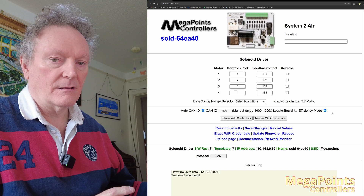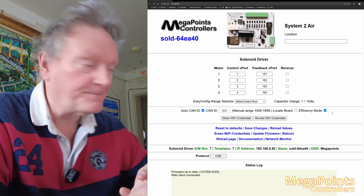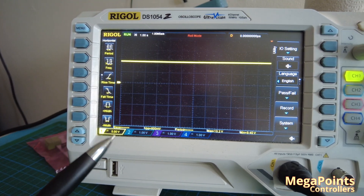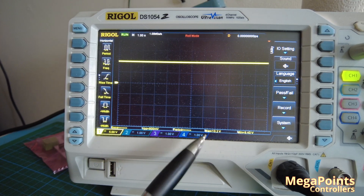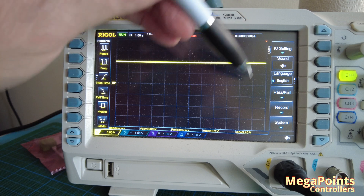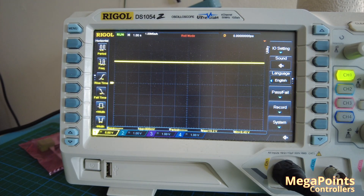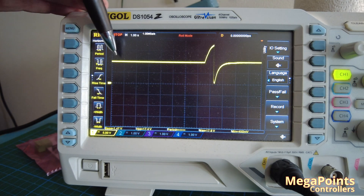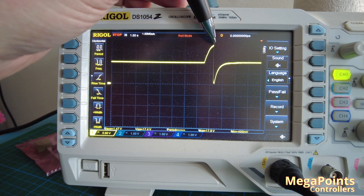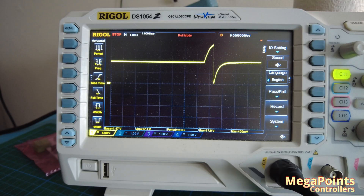I'll put the camera in front of a scope so you can see what's happening with the charge voltage. This is the current capacitor charge voltage, currently sitting at about 10 volts. As I fire a solenoid, this voltage will rise, discharge all the way down to zero volts, and then come back and rest at 10 volts. Pressing the button now — it charges when I press, up to 16 to 18 volts, fires, which drops it down to zero volts, and then comes back up and rests in a discharged state.